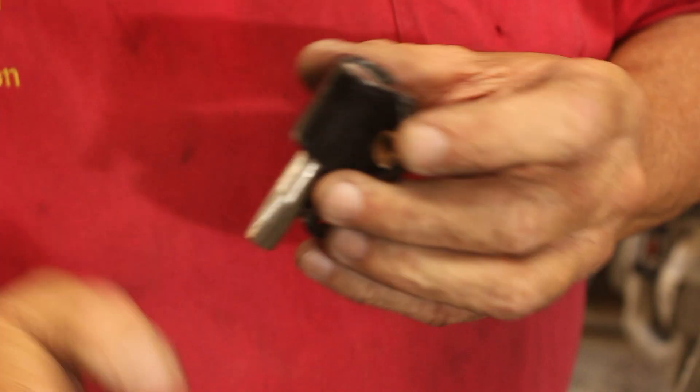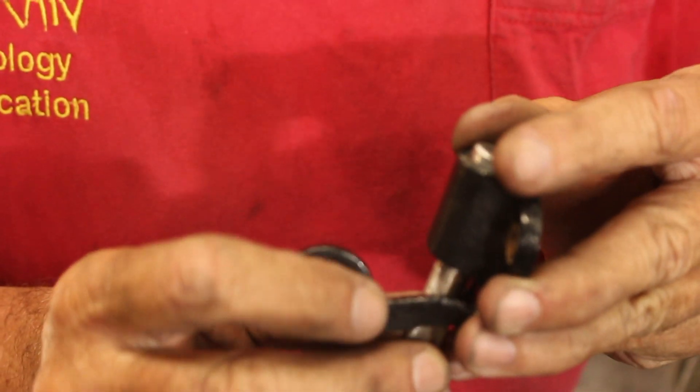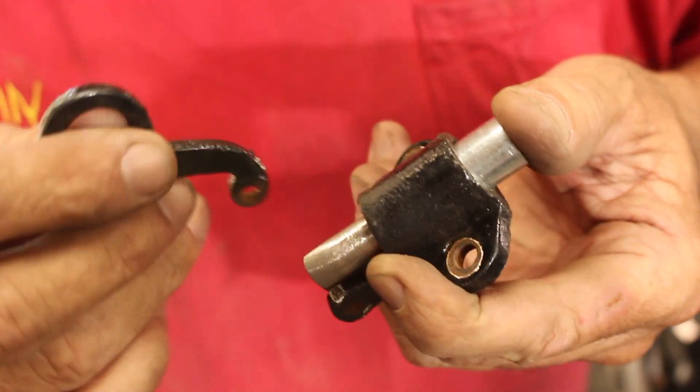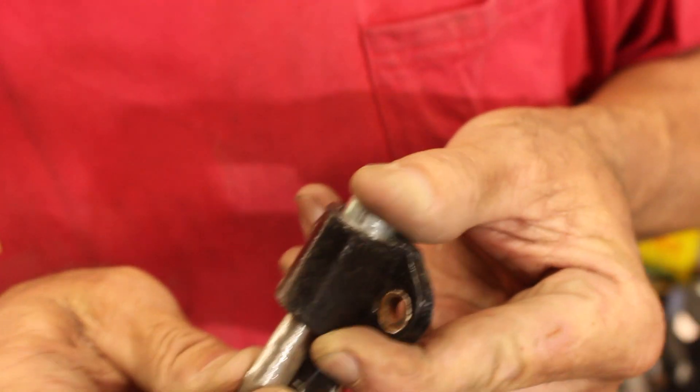So I have the bolt made and I put a little bevel on it. Now the next thing that has to happen is I need to get a spring on there to keep that held up, and then we'll punch a hole right through that cylinder. That's where the lever will slide through — when this pulls down it will actuate the bolt. By some stroke of luck I had a spring hanging around that was just about the right size.